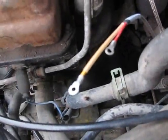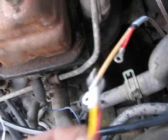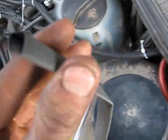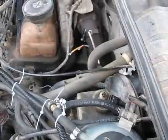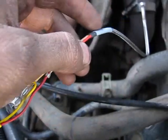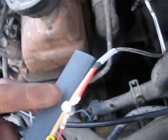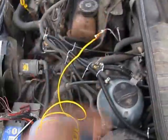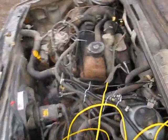Okay, so we got our thermocouple here. What they say in the instructions is, since it's offset, you're supposed to keep them offset. I'll connect those two together and then run this yellow one up and back to that. They also give you some really awesome heat shrinks. Just sleeve that guy on there and Bob's your uncle. So you can see how I've connected it — that's how they show it in the book. Now I'll run a piece of heat shrink from this all the way up to there. Actually I changed my mind — I'm not cutting this, so I'll just sleeve the entire thing and heat shrink her.